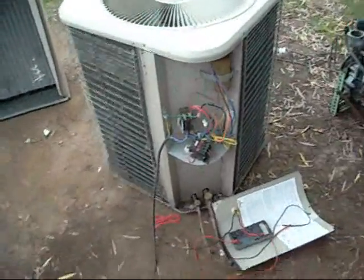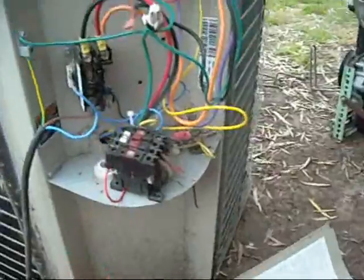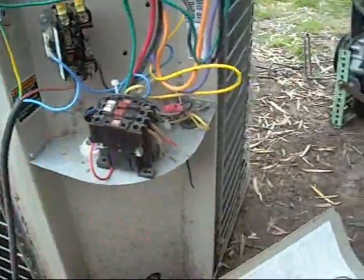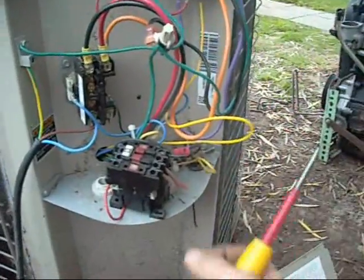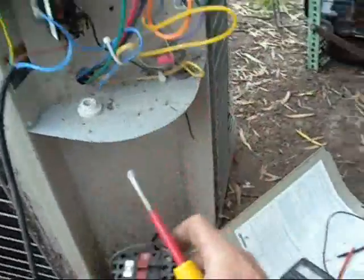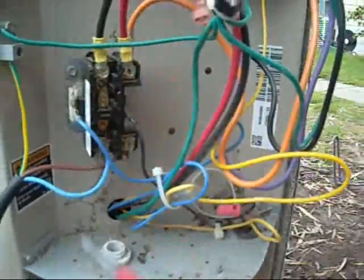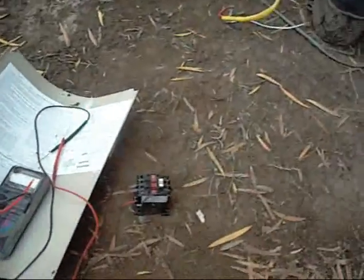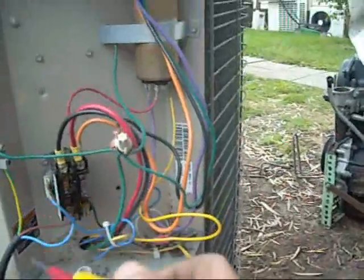OK, this is the part you've been waiting for - let's see if the old dog runs. Always use an insulated screwdriver to push the magic button, particularly on these contactors. Funny thing about American stuff - they're covered with warning labels and grounding labels, but they've got the most dangerous-looking contactors and these wire nuts which aren't even approved in Australia. This is a normal contactor like what I'm used to, covered in plastic, and you've got the magic button there which you can push with your bare finger. That one I'm not going anywhere near - even though it's on the neutral wire it's still hot with respect to earth, so you don't touch that.